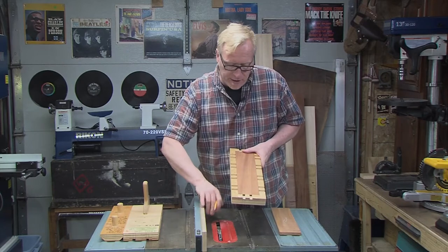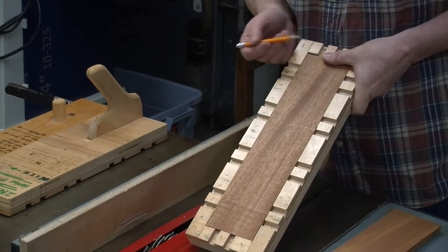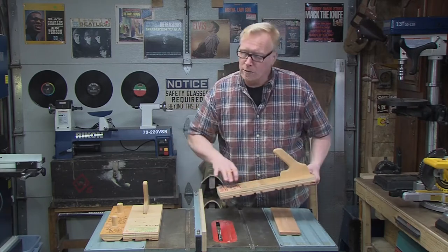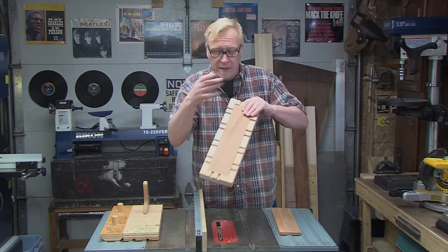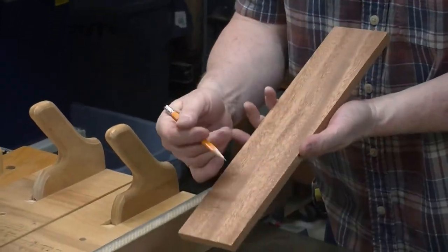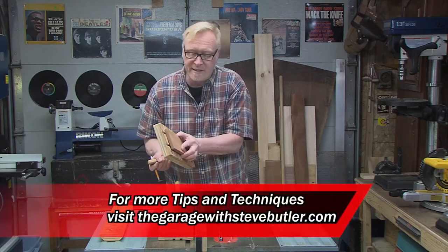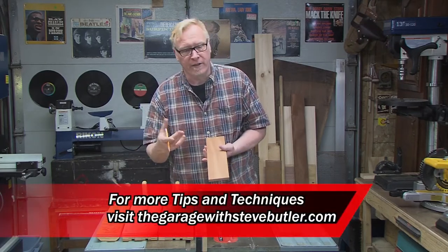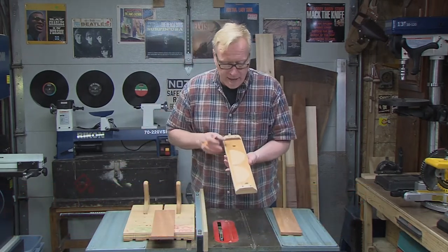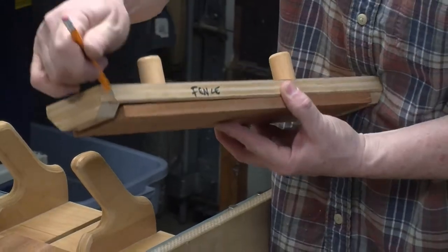I've set my fence at a certain dimension and run a groove down, then move the fence over and run another groove. I use my crosscut fence, leaving this fence the same, run a dado, move it over, run a dado — so we're making a bunch of criss-crosses essentially. Then I'm going to have one face cut. I'll then put that in my second jig and do the same thing at a different dimension, and that's how we get all those perforations. I have a third jig I use to guide the board and cut it on a 45 to cut the miter.